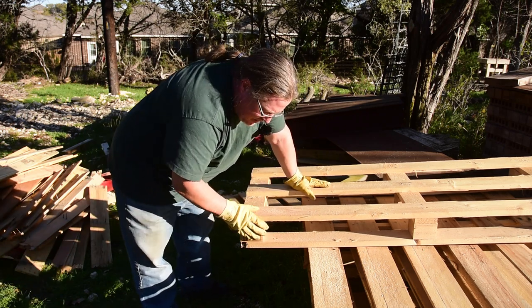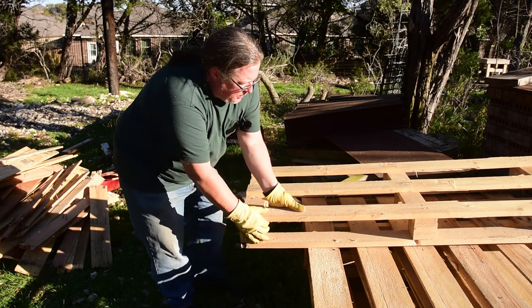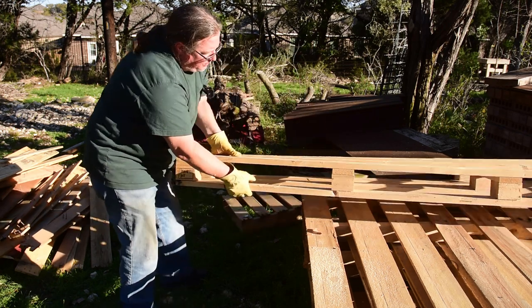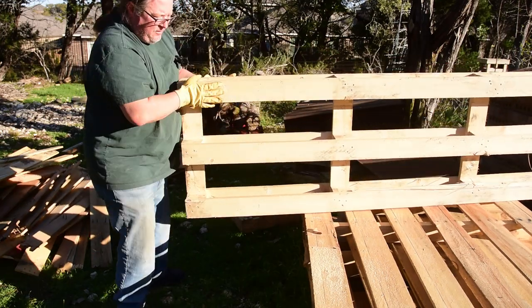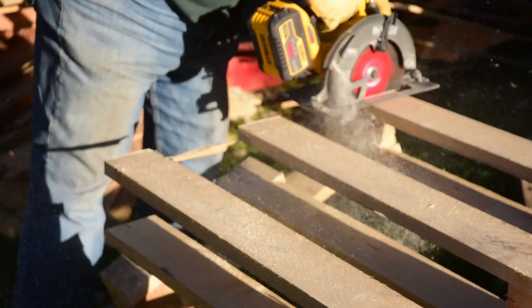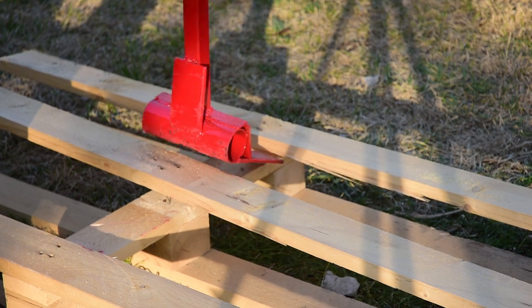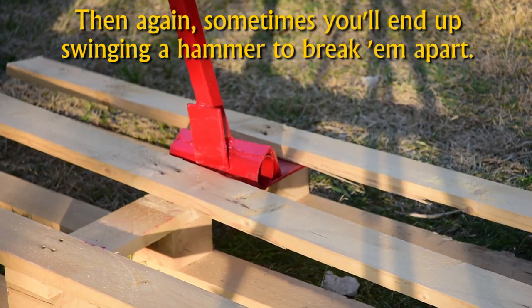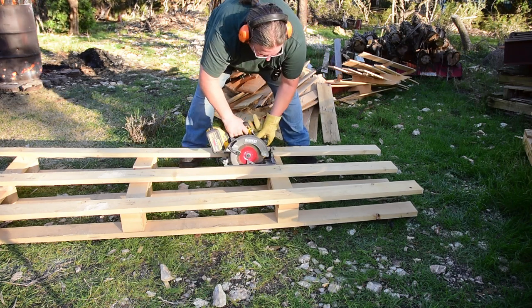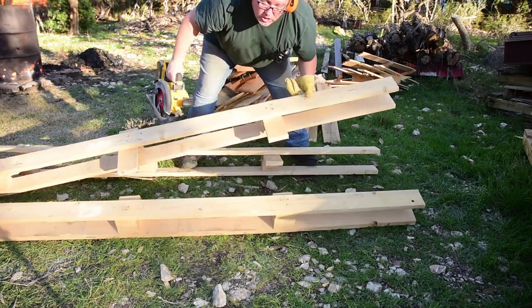With these European-style pallets it really is better to cut the ends off first to get rid of the huge chunks. I can get my pallet buster in at an angle on the interior ones, and then just use a hammer on the other side since they only put crossbeams on one side. You can also use the pallet buster on the side to wedge it up a little and then stick it underneath to do the rest, or just cut the crossboards — there's only one of them — and then take it to a workbench to hammer them out.